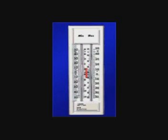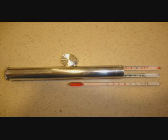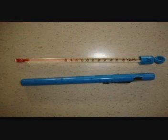Many types of thermometers are available. Recording high-low thermometers can have a discrepancy of as much as five degrees. Thermometers that are not etched but have their scales printed on wood or plastic can often be slid up and down, changing their readings. There are thermometers that are pre-certified, but their costs are prohibitive — $80 each USD. When a laboratory needs 50 to 100, the costs add up. You can purchase inexpensive thermometers for less than $5 each and certify them yourself.